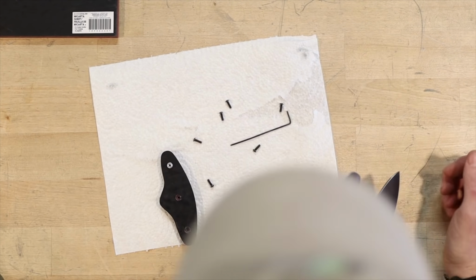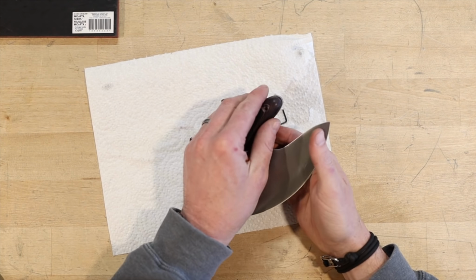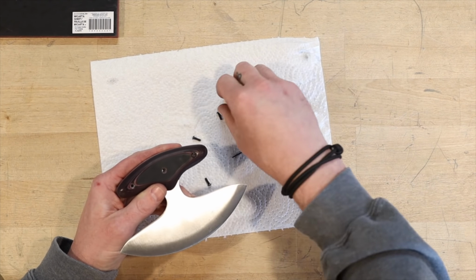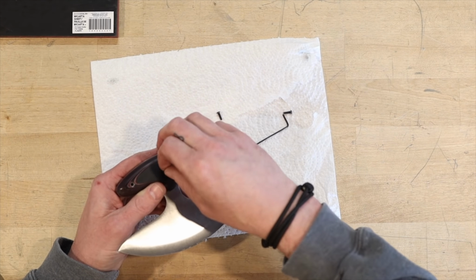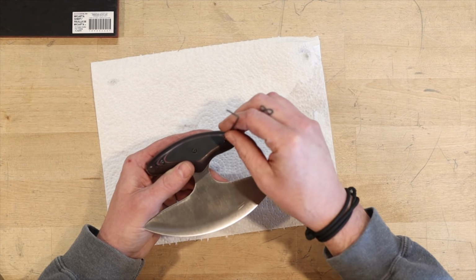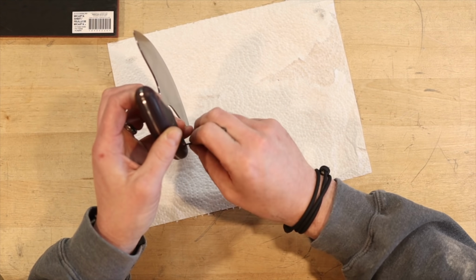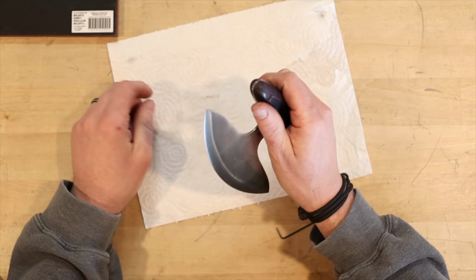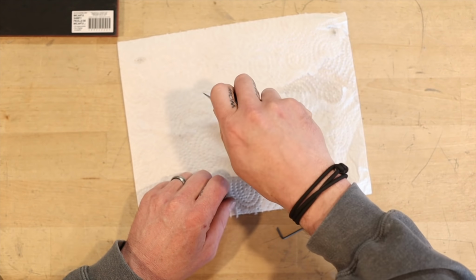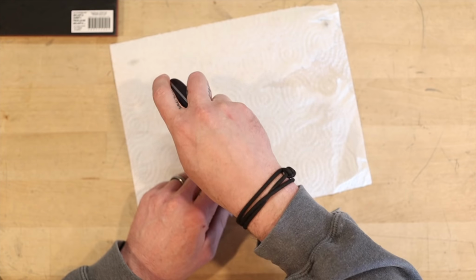Now, in the final assembly of this knife, even the oils from my hand were starting to create stains. And so, as far as a choice in steel for kitchen cutlery, this probably isn't it. Mostly, I liked having such a large piece to work with. I liked the fact that the profile, the radius, was already there, and it's actually a really nice radius for cutting herbs and stuff like that. So I'm interested to see the patina that's going to develop on this. But the frustrating thing was when I went to take the beauty shots, the blade was already looking like garbage. It was not as clean as when it came off the grinder. So I'm just going to have to live with that. Again, like I mentioned, maybe a vinegar patina in the future would be kind of cool.